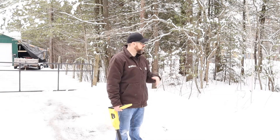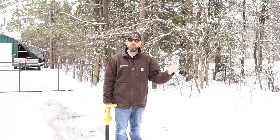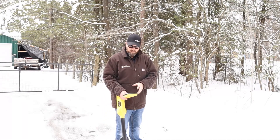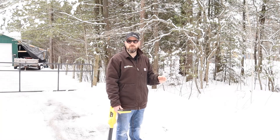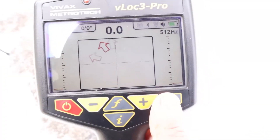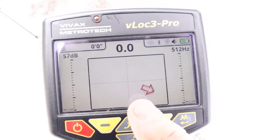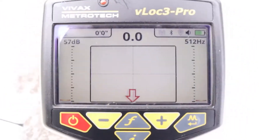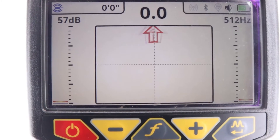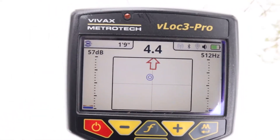So here we are outside. We're in the area where I believe the pipe is coming out. Because it was a straight shot and I didn't see any 90 degrees in the actual pipe when I was pushing it out and looking on screen, I believe it's going to be in this direction over here somewhere. We've turned the receiver on, we're in 512 Hz, and we're going to start walking in the direction that the arrow shows us. We've turned on sonde mode by pushing and holding the M button, then pressed the F frequency button to get into 512 Hz. As we start to get close, it starts to lock in — we're going through a little bit of snow here.